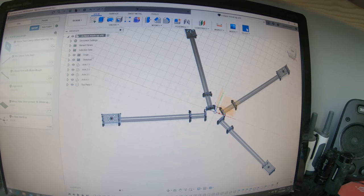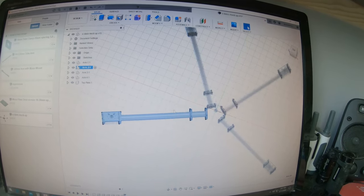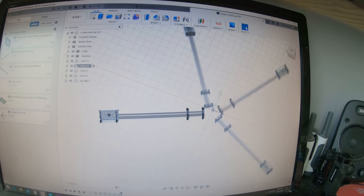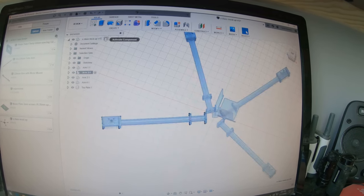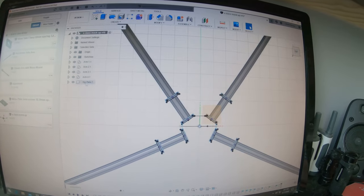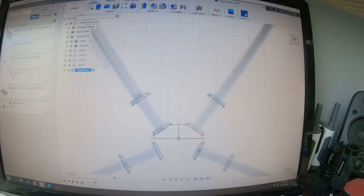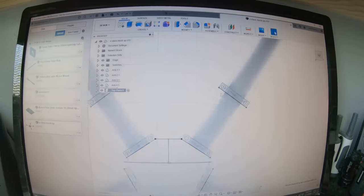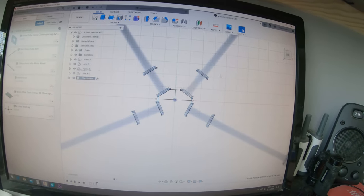I can go in and move individual arms by selecting the components. That gives me the ability to make changes to arms - move clamps, things like that. I can go back to the entire thing. If I want to, I can come in on the top plate, design my top plate, and reference these holes. I can tag these holes perfectly for getting the plate sent off to either my 3D printer for mock-up.